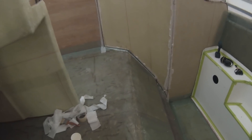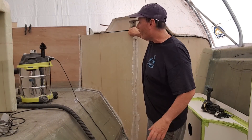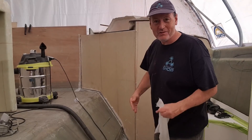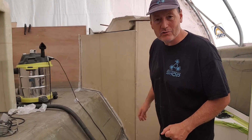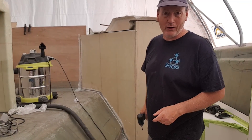It's harder than I thought it was going to be. It has to go dead square into position and dead square against the one already tabbed in place. Now it's all filleted and I've put peel ply all over — I've got a really nice joint along this line and the end grain was tacked up by filling with resin and letting it tack off, which aided in holding the filleting compound. This whole bulkhead is now fully complete. All I need to do is tab this region — remove the peel ply, put in probably three layers of 600 double bias to make that really sound, and fill the locating screws with vinyl ester.